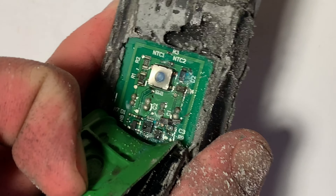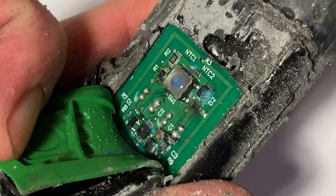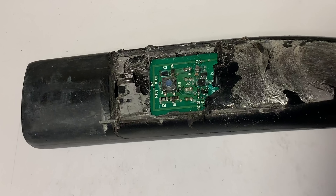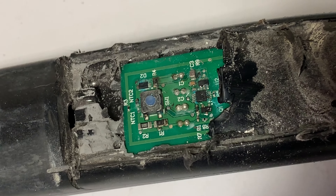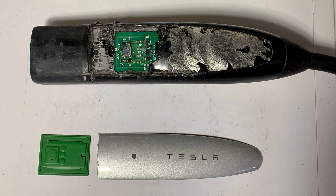But when I touch it, there's my problem — I can see water underneath this gasket. Peeling it back: yep, everything is wet. You can see charring on R4 and corrosion on D2. No doubt that switch is full of water and this board is fried. I found the problem, but I would have expected this to be potted more, completely sealing that board. Perhaps it was just a manufacturing defect that allowed water in, which no doubt started to freeze and thaw and make things worse.